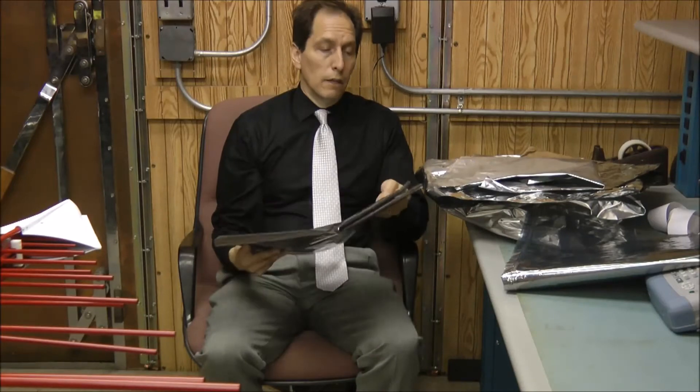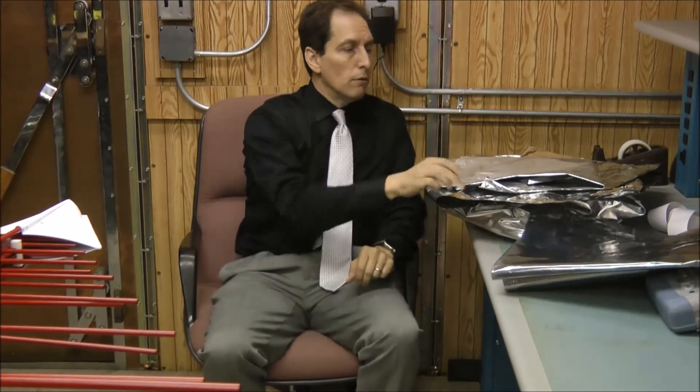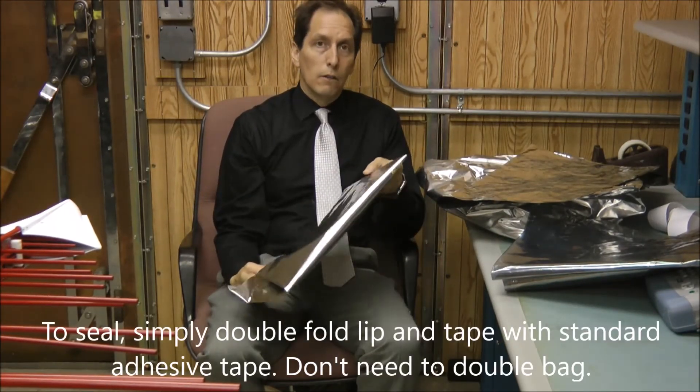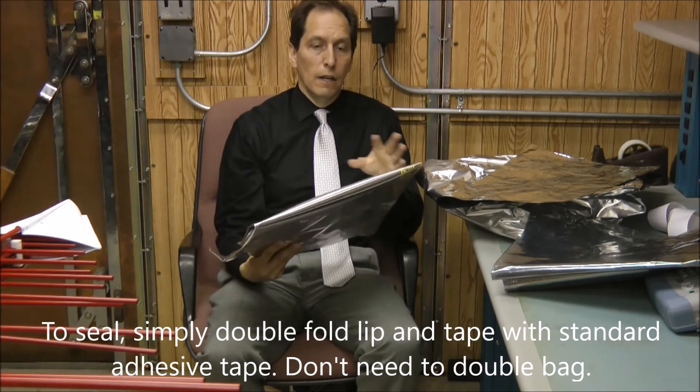There are various types of anti-static bags out there. There are some like the ones I just tested, which I don't recommend — they only provide about 10 or 15 dB of protection. There are also some that do a very, very good job across all frequencies of interest — they might provide 50 dB all the way from 100 kHz to 1 GHz. These are great one-stop Faraday cages. You put your items inside, you fold the lip over, tape it up.